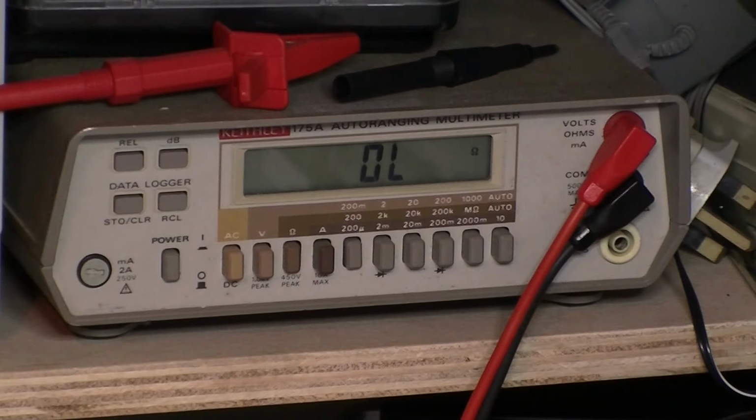Okay, well, let's continue. So now you should be able to see my bench meter. I'm going to need to get some multiple cam setups, I think. This is crazy. So, first transistor then, this is an AF115. Let's make sure the leads aren't touching. So I'm connected to the shield now. Let's put that into auto ranging. Again, really we shouldn't get any readings here, but let's have a look.